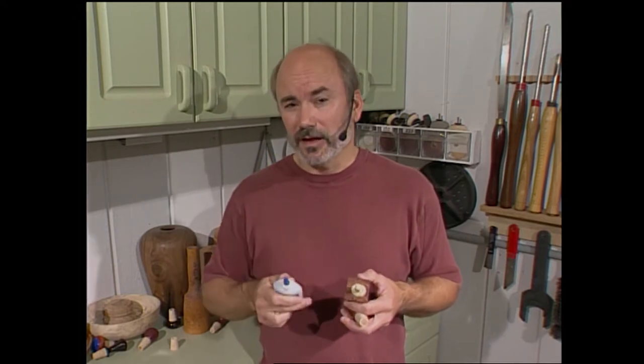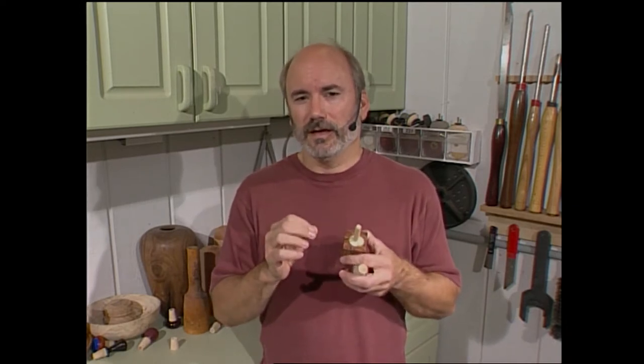I use super glue a lot on a lot of my projects. But when it comes to wine stoppers, I started getting some failures. That type of glue will get very, very hard, and it becomes somewhat brittle. By taking it from room temperature and putting it into a refrigerator and back again, after a while the glue starts to just break down and fail. It works for some people, but it just hasn't worked for me.